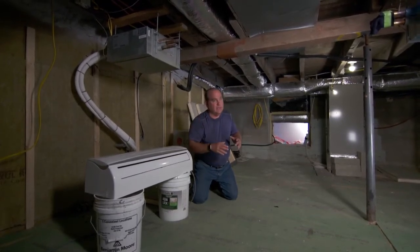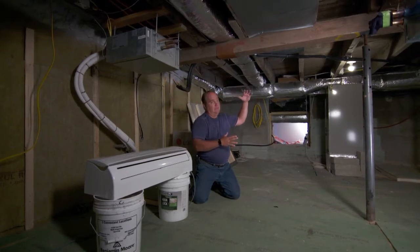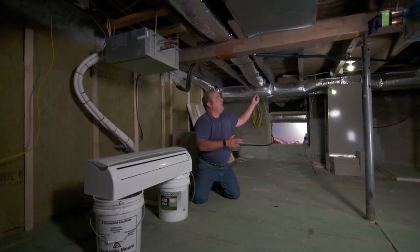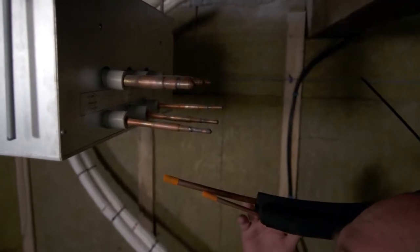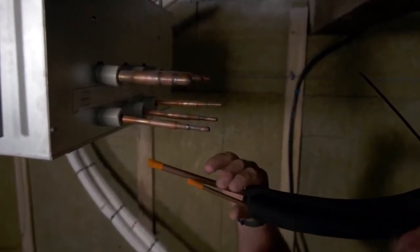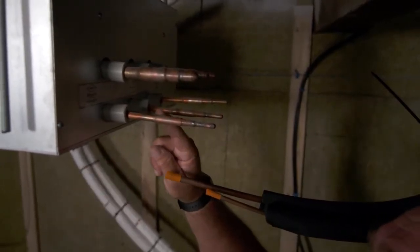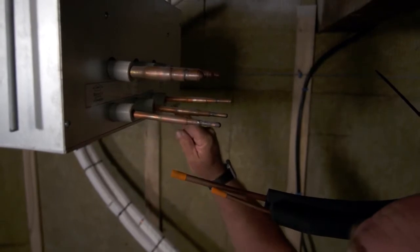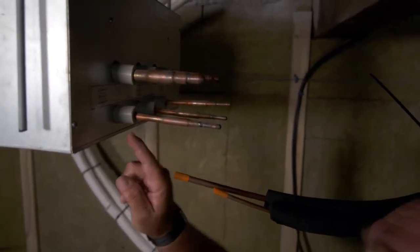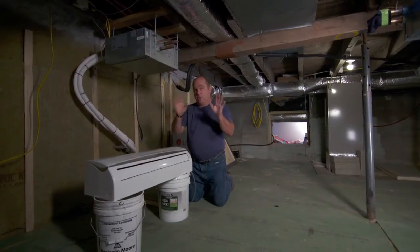This is where the system really shines. If the sun is shining on the top floor, meaning it needs air conditioning up there, when you air condition you bring back the heat that the sun put into the building. It comes down to this very smart box, and the box is smart enough to decide: do I take that heat and send it outside, or do I keep it in the building and use it — sending it over to the north side air handlers if needed? And that's so brilliant.